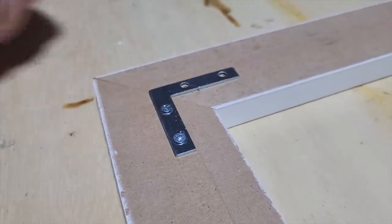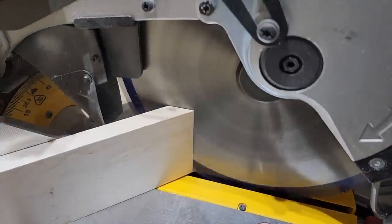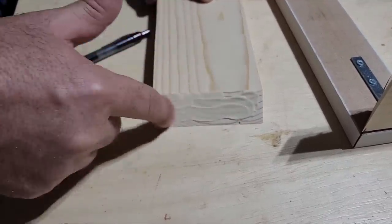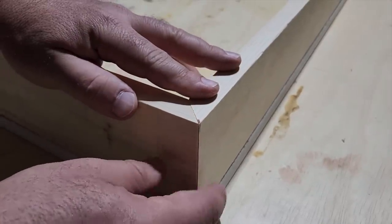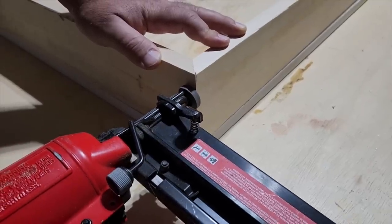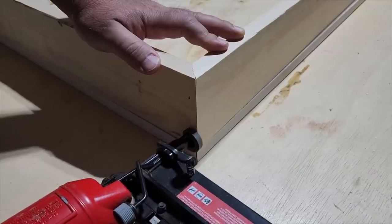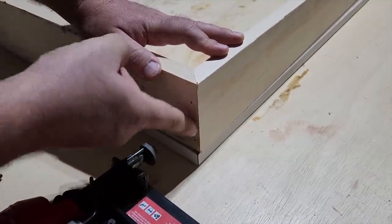These corner braces do a great job holding it together. Once you get all four sides, we've got to build a box so we can cover the sides of the TV. I use a little bit of one by four, and again you've got to use that glue — it holds the sides together. We're going to use 45 degree cuts, and look how smooth that is. You can use screws or nails, but I go ahead and use a brad nailer. It's real easy to use and puts a nice fine fastener right inside — I just use three on the side and it gives it a nice smooth look.